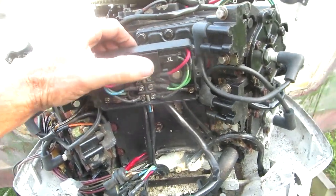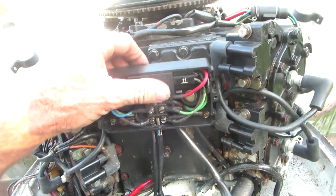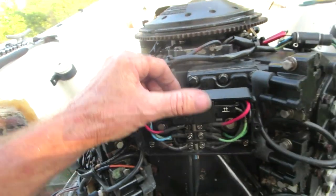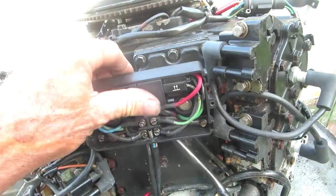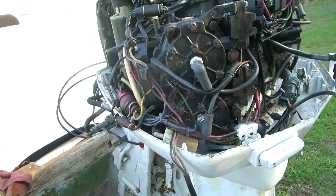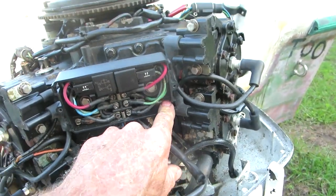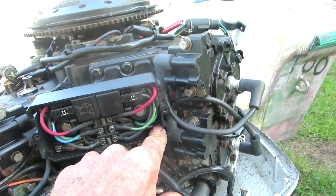One relay is up, one is down. These relays will go bad. When you're trying to find out what's going on — with your battery switch on, not necessarily the ignition — if you actuate your trim switch and you can hear the relay clicking, that means you've got power all the way from the switch to here. A little tiny 20-amp fuse can blow and kill your power — you'll have only 5 volts instead of 12.